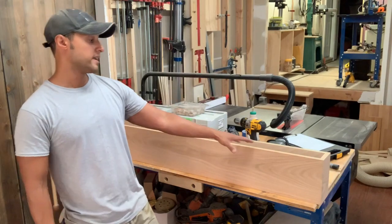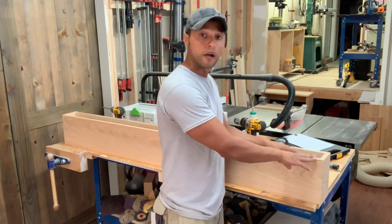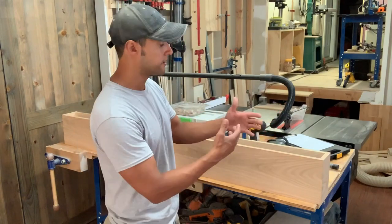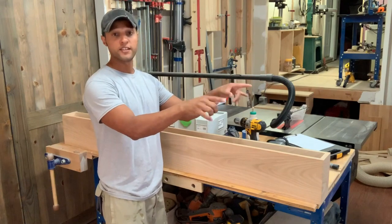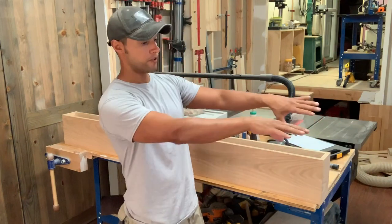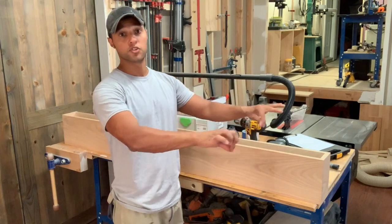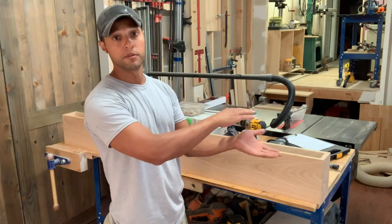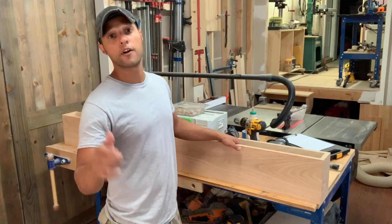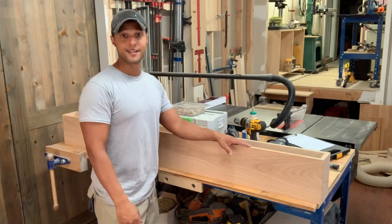Today's video was just about cutting 45-degree angled cuts on the flat using the bevel function of your miter saw. Hope it was informative — hopefully you can use this if you have this problem. Just remember to remove the upper fences from your miter saw, or if you have the saw on a contractor stand with no fence in the way, just loosen the screws, slide them out of the way, tighten them back up, and you're able to bevel the saw back and forth. Alright guys, if you like the video give it a thumbs up, don't forget to subscribe, follow me on Instagram and Facebook — links in the description below. Thanks for watching and I'll see you guys next time.